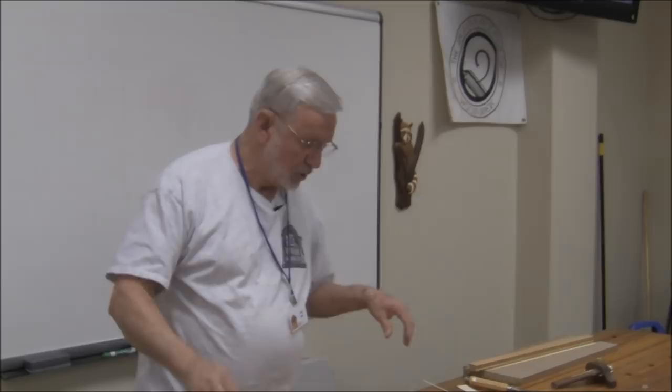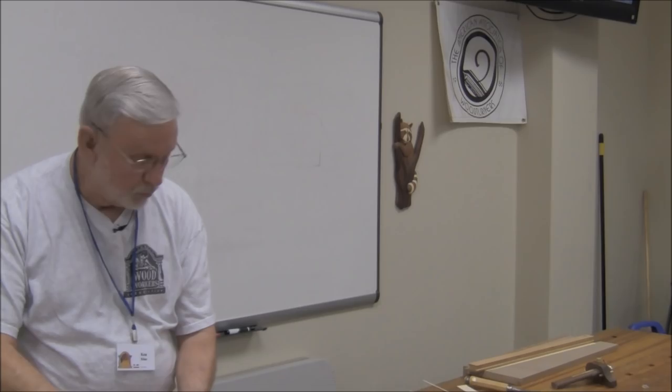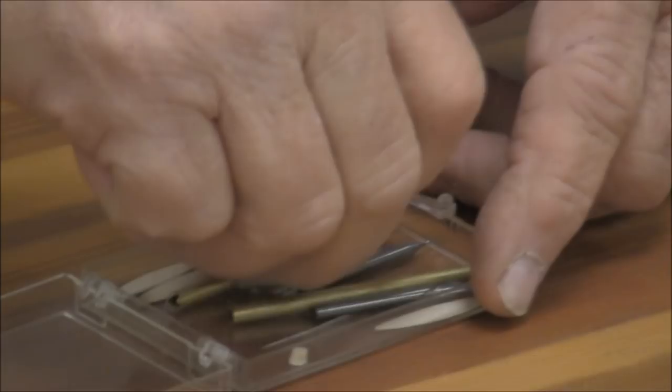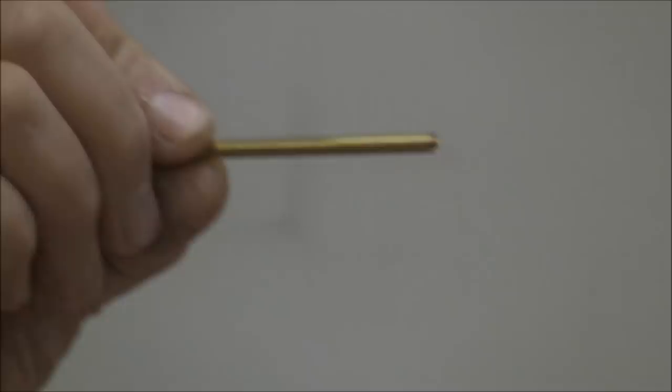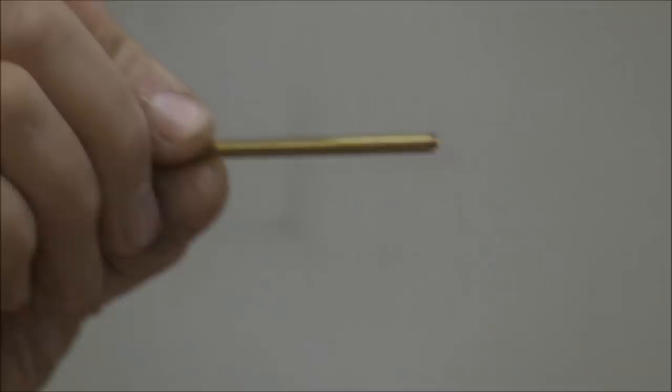I love this one — I'll pass this one around too. When you're putting berries — those are little tiny round pieces of wood — in the furniture, the way I do it is I take a piece of tubing and cut teeth in it. I cut them like rip teeth. I'm going to pass this thing around, and also in there I've got some router bits, some Exacto blades, and a couple of bellflower leaves that I've sand shaded.